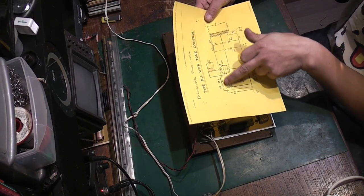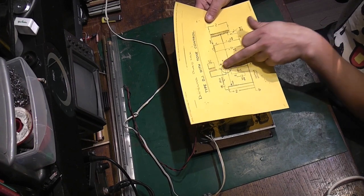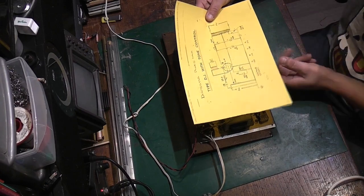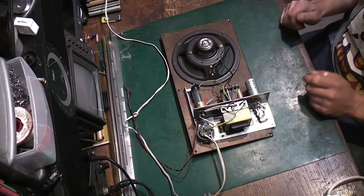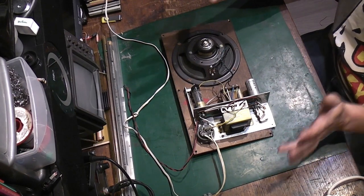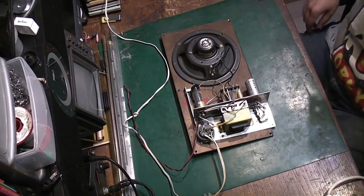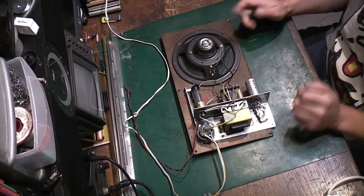One of the other grids is connected to the tone correction circuit through that capacitor via the anode. So there might be a little bit of voltage on it, but we'll get to that. First things first — we need to find out why this amplifier is not amplifying, because at the moment it is completely dead. The valve is lighting but that's all we're getting. There are some really simple basic checks we can do before we even start applying voltages.